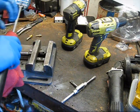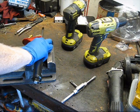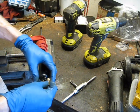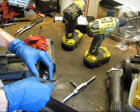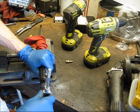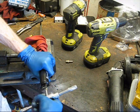Now is the really tedious part — actually tapping the hole for the barb. This is so tedious because it's really trial and error: you tap it and just keep checking it until the barb sits where you want it to. I know some people might give me a hard time about not having any lubricant on the tap, but it's aluminum for goodness' sake — it's not going to hurt the tap at all.